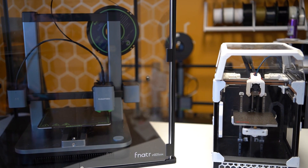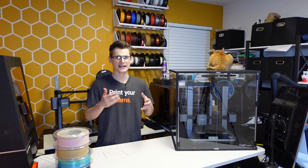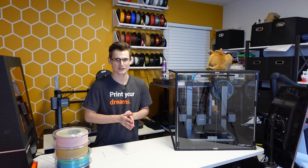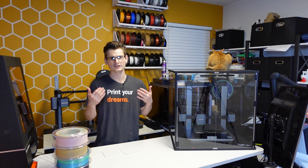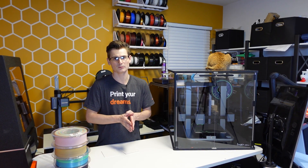About a year ago when I was preparing to build my Voron 0.1, I had never actually printed ABS, so I had no idea what I was in for — and I suspect many of you are in that same boat. Trust me when I tell you that ABS really stinks, and it is not something you can hide from. Even worse, it is incredibly toxic, so you really shouldn't even be in the room while it's printing.